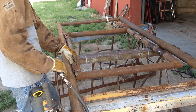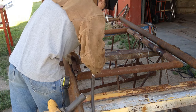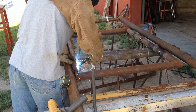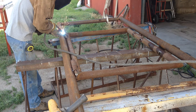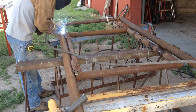This gate is only going to open one direction, so the hinges are set up a little funky. The reason I'm making it open one direction only is because it's going to be right next to my stock tank, and this is the outside of the corral. If they get through this gate the cows will be out, so it'll open into the corral only — that way if it doesn't quite get latched, hopefully a cow will bump it shut, lock herself in, and not exit the corral.